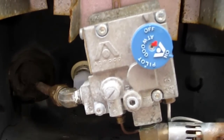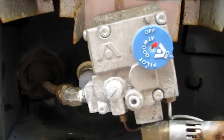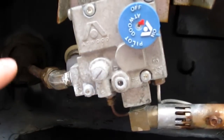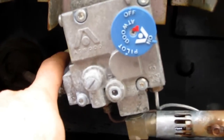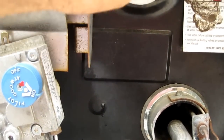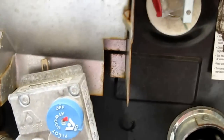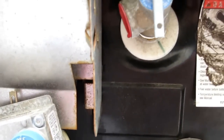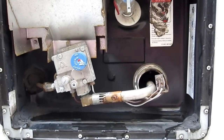So anyway, after you open this, you just clean a few times again to remove as much vinegar as you can, and clean the bottom of the tank because you have a little bit of water on the bottom. So do the process a few times. Then when you finish, close this, reopen your valve again, and then refill the tank with fresh water. And after the water pours out again, you shut off and let it fill up all the way at the end, and then you turn on your faucets inside, the hot and the cold water, to let everything come out.